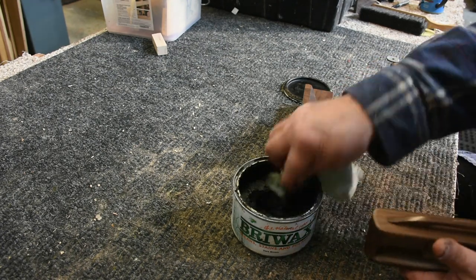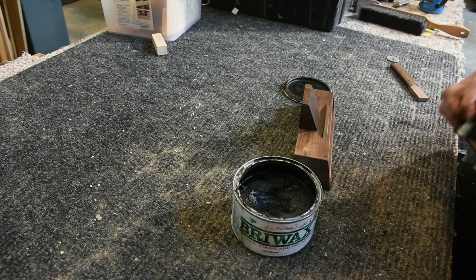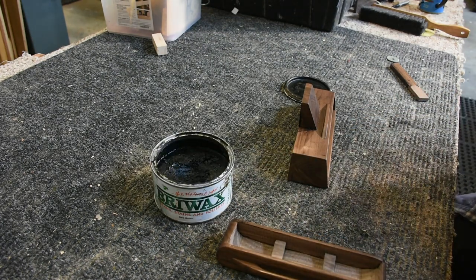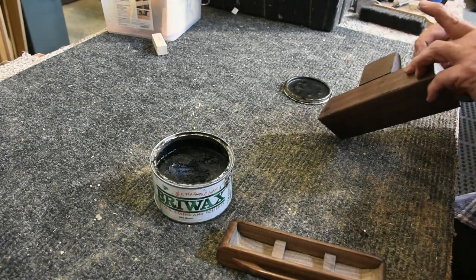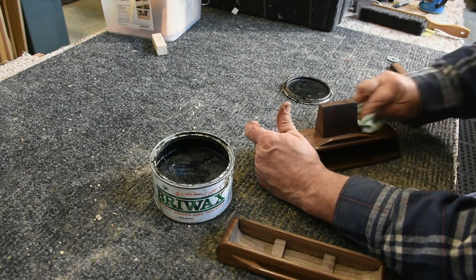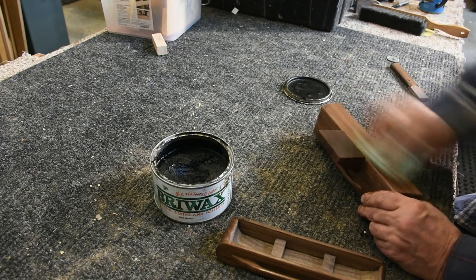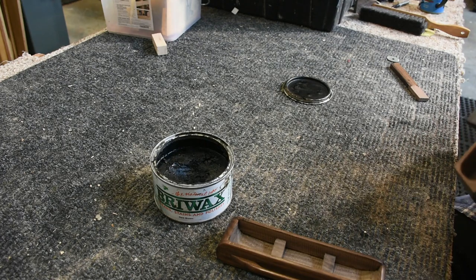This is dark walnut and the wax works great with it. I'm careful to do only the top edges and not get any wax on the inside area that will be flocked. I always do the waxing first so none of that dark residue gets on the inside of the drawer. There's the sheen you get from it. So to recap: four coats of semi-gloss lacquer, knocked down with steel wool, then waxed.